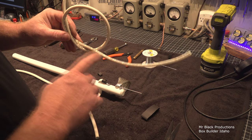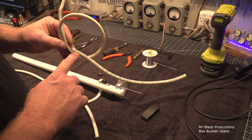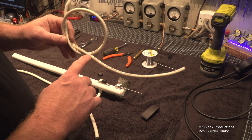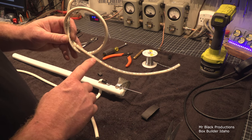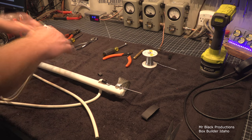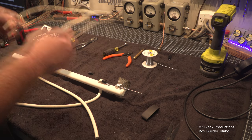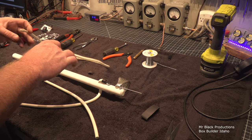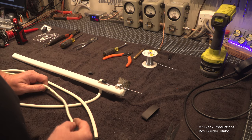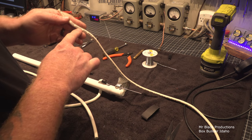So the things that they're telling you in this first statement are really important: the type of strand, the style of wire, the environment it's designed to go in, its lot number, and how many volts it's rated for. What they're stating is that, let's say this black towel is a piece of metal. In theory, you could run 40,000 volts through this, low amps of course, and have it laying against the case, and it's supposedly not going to arc through. Supposedly. Hence the reason they say DC.